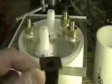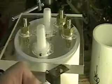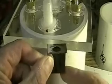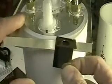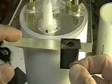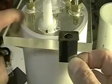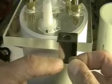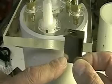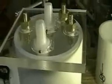So again, what's happening is I have this plate here. It goes down. And when it touches the water level, in common with one of the other electrodes here, I measure the difference in if there is electrolyte between these two plates, meaning the plate that's on the cell and this plate, then I can connect that up to a transistor or whatever to determine the water level. And that's going to work out just fine.